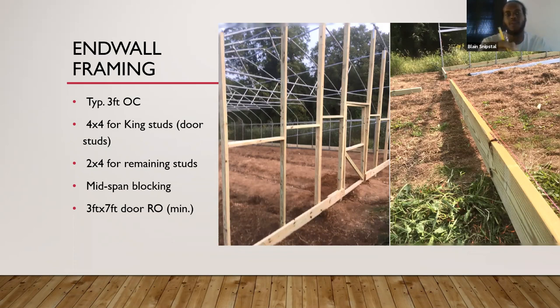Like back in the day, what they used to do before they came out with all these straps and stuff for these lower end companies, if you will, that weren't servicing the high, like, glass greenhouse industry. People would scribe it, make that angled cut, and then they'd drive a bolt through the hoop, through the post, and then bolt them all together. Or they'd run nail strapping over that and sort of hug it tight to that. But in this circumstance, you don't.